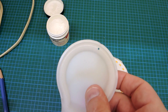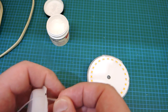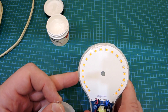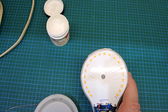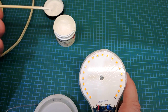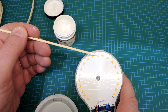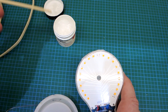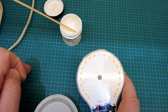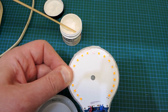I've drilled a little tiny hole — that's sufficient to allow the thermocouple to pass through. The next thing I need to worry about is getting enough thermal transfer between the thermocouple and the LED. To do that I'm going to put some thermal compound on the LED. I was actually hoping to use a thermally conductive epoxy, but unfortunately my local electronics store had sold out, so I'm going to dab this on. The challenge is I still need to mechanically secure the wire so it doesn't move as the assembly is screwed back into the lamp base.